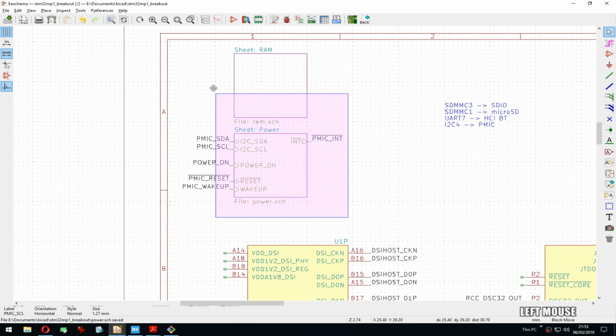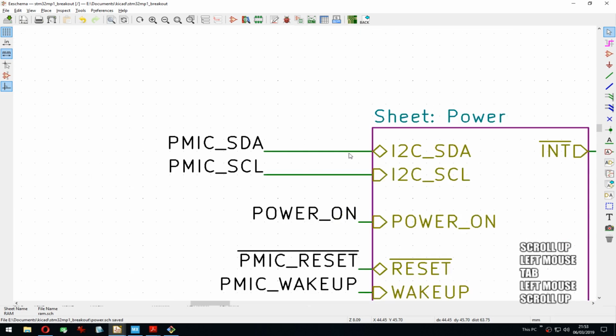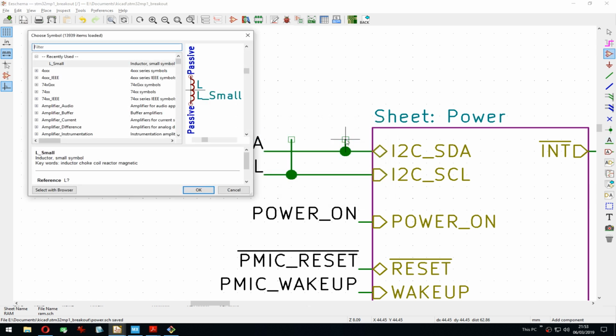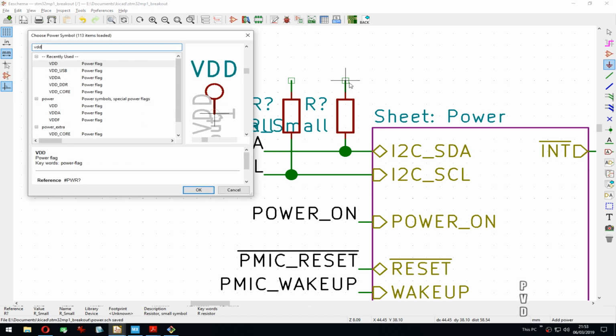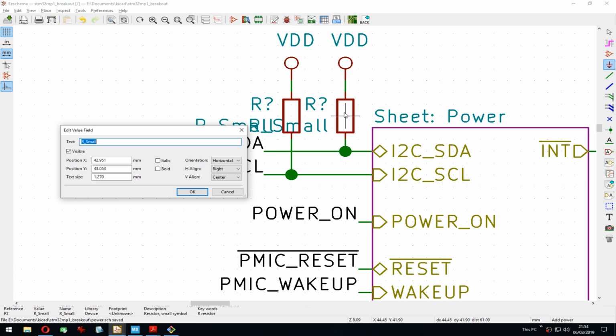And we don't want to forget. Let's move this out. No. The pull-ups on the I2C. Not that I would ever forget that. Yeah, that happened. Luckily, we can fix it on the PCB later, so that's okay. We're closing in on 2 hours, which actually went really fast for me. And it's kind of too bad because I could actually keep going, but 2 hours seems alright, and also it's a weekday, so I don't want to do it for too long. So let's see what I can do after I add these.